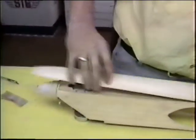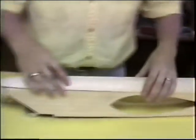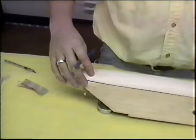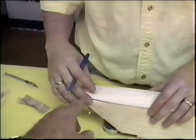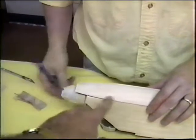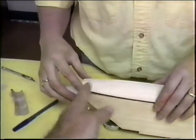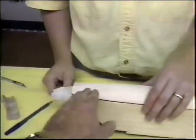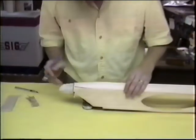See, now, if you want to bring that up, just see how far you've got the spot marked where it can go to the back. And you could trim that off. But what I'm saying... We don't want to trim it yet. No, what I would do rather than that is wait till you get this all and we get the sides done on a belt sander. And then just sand a little bit until it just blocks right in and you got that contour just right. Yep. I would rather do it in little baby pieces than try to do it all at once.